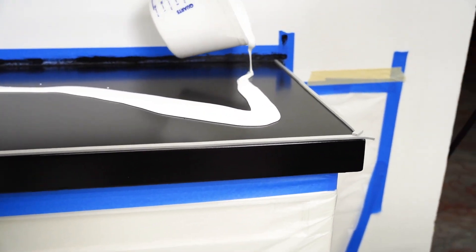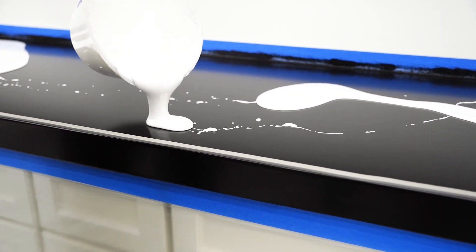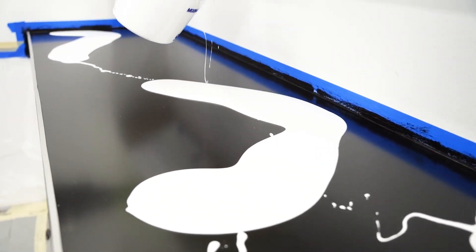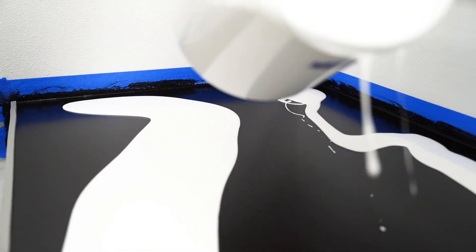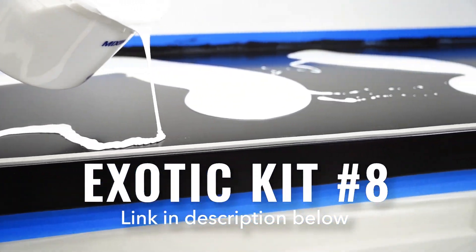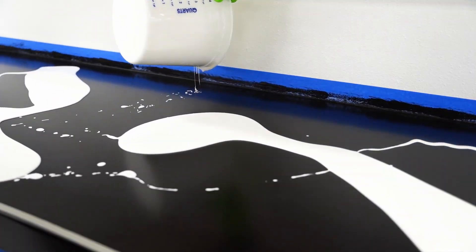You can simply dump out as long as you're doing eight ounces per square foot. You can dump right out and it'll fill in and level out — you won't have to do a slicked-off surface or put a thin coat of epoxy on your countertop first. We've got our black epoxy pigment and our white epoxy. This is going to be a really cool counter — really popular colors, black and white — and we're going to get some cool effects using these two pigments.